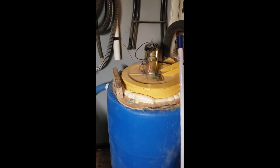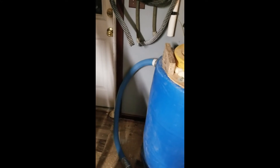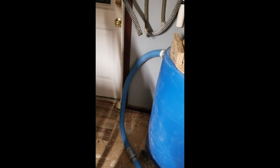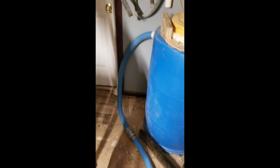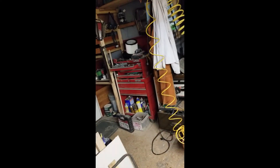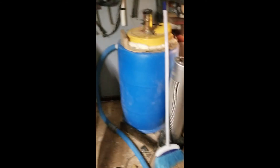The other issue I have is I bought a pool vacuum hose — it's corrugated on the inside, one and a half inch, and not big enough to suck up some of the shavings, so it clogs. I also installed overhead pipes so I wouldn't have to trip over the hose, but I used one-and-a-half-inch pipe with 90-degree elbows — wrong thing to do. I get clogged up all the time. In fact, yesterday I accidentally sucked up a rag and it's stuck in the pipe, so I've got to take it all down and clean it out.